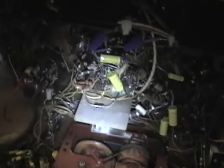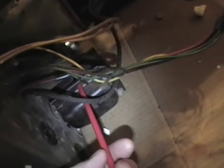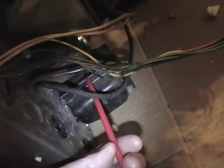The downside of running filaments off the AC line is that a power surge can blow out some of the tube filaments — worst case, even the picture tube filament. So what this set has is a hybrid: there is a small power transformer, but it's only used for the filament voltages. The main power is still derived right from the AC line. It's the best of both worlds — the transformer is about half the size it would normally be, giving you weight and cost savings while protecting the tube filaments.